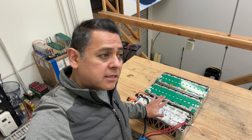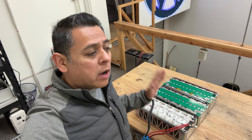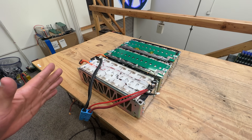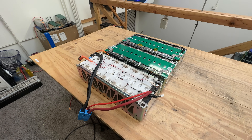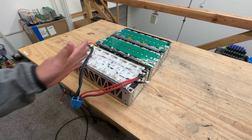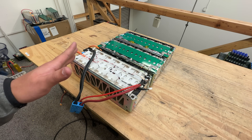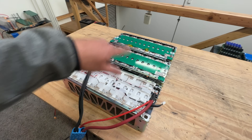These are great — testing at 100% of capacity. What can you use these for? As you saw, there is certain equipment that doesn't care that these are not exactly 48 volts. Grid-tie inverters, for example — I know someone is making a 44-volt inverter for Tesla packs, because two Tesla Model S modules in 12S would be the same voltage as this. I'm going to look into that — I think someone already designed and is already marketing a big six-kilowatt inverter, a split-phase that you can run your entire house off of.